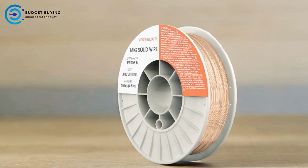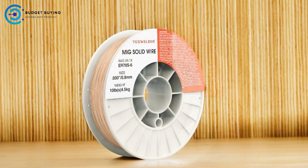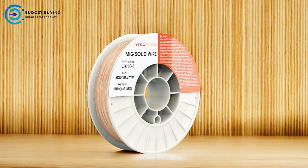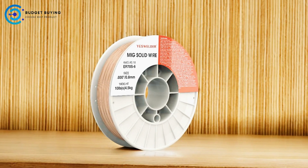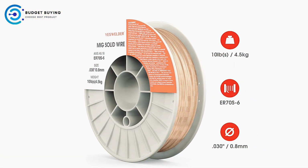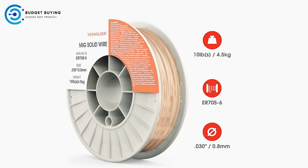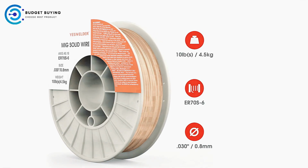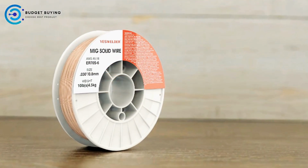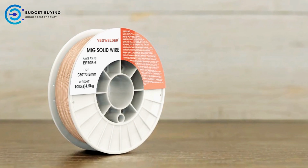The ER70S-6 wire is perfect for a wide range of applications, including construction work, farm implement fabrication, shaft buildup, tank and truck body repairs, and general shop applications. It excels in situations where there is poor fit-up or where the materials are rusty or oily, making it a reliable choice for tough and challenging welding jobs.